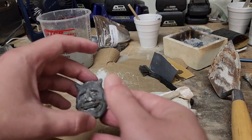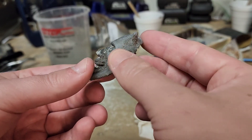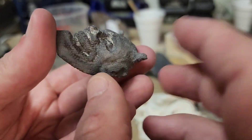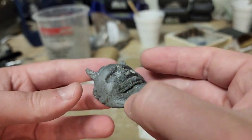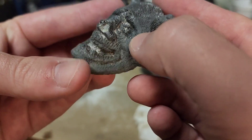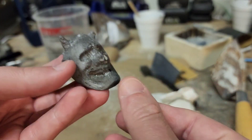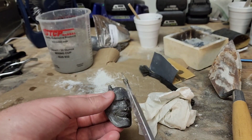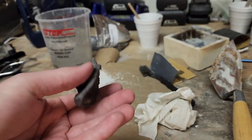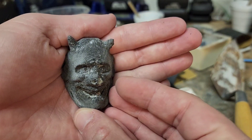I've cleaned this up just a little bit. What do we have? I have an almost undamaged Hanya mask. There are a few pieces around the nose that didn't quite sinter or debind properly. It was placed in the crucible and when I put the element in, it could have cracked just then. But other places like the teeth and around the eyes held up very well. Even the horns, which in the past were challenging — they seem to have stuck. It feels solid, taps solid, and makes very satisfying clinking noises when you drop it on the table.